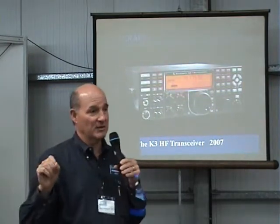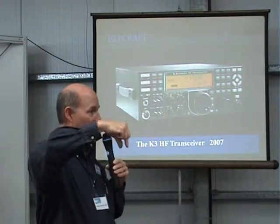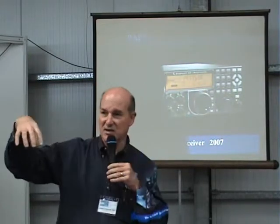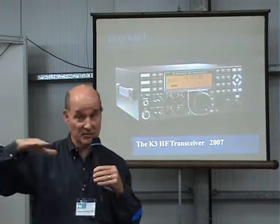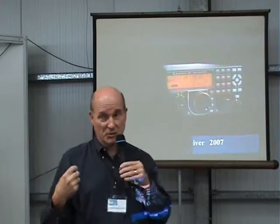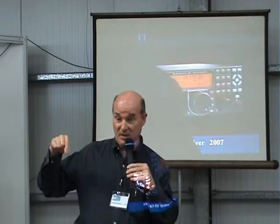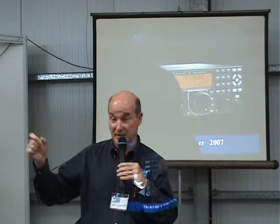So we ended up having a special test fixture that we designed with a close two-tone test at high power into the crystal filters. We do that after we run a high signal through them, like at plus 10 dBm for 20 or 30 seconds to stabilize them. That actually broke them in at the first level. But then you get the standard filters over, and part of the reason we hooked up with INRAD is we chose an 8.215 IF, which is the same as Yaesu is using in their FT-1000MP and those radios. They figured there'd be a lot of good crystal filters in that category.